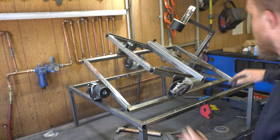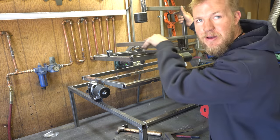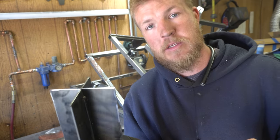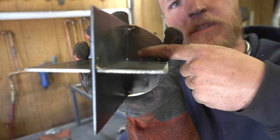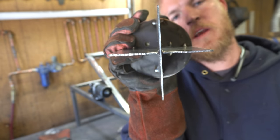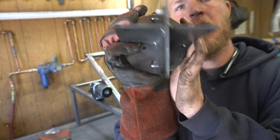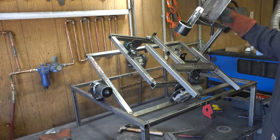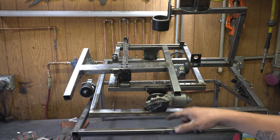We've got our two axes for following the sun and a CNC machine on top — I think this is going to be pretty sweet. Before electronics, I've got one last thing to install. I 100% stole this design from Great Scott — put a little link up there for you. This is like an X-block, and each of these holes in the base gets a photoresistor. That way we can program this thing so that if this side is dark, it'll move this way; if this side is dark, it'll move that way — so this will always be pointing directly at the sun. This guy is going to go right there. Now all that's left to do is install our steppers and belts and do the electronics.